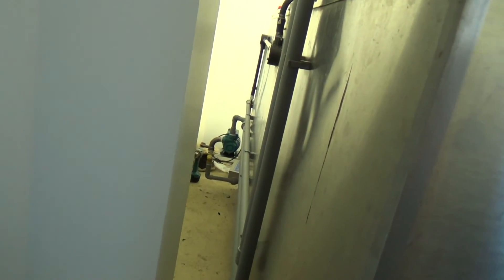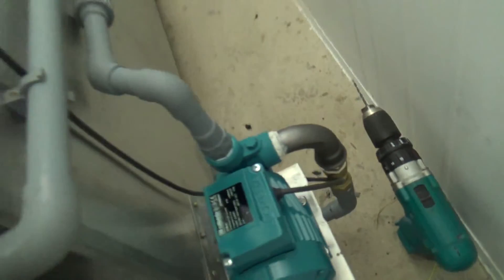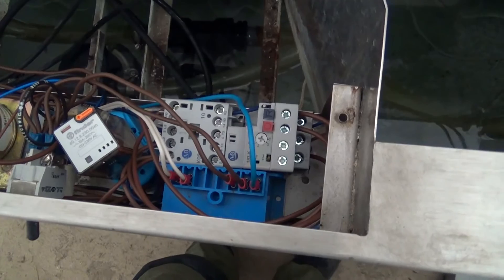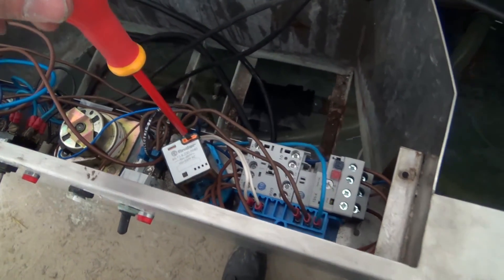That's the chilled water pipe supply — we turn up the top and then down the side. I'll put a Y strainer in there so if there's any rubbish it'll catch it. We've run the pipes, and at the bottom of the tank where the drain used to be, we took that out and put a fitting in there with a tap so we can change the pump if we need to. We've put a contactor in there for the pump, and that relay is to talk to the robot — so when the robot says it's milking, it'll bring the pumps on in the tank and also run the little pump down here.